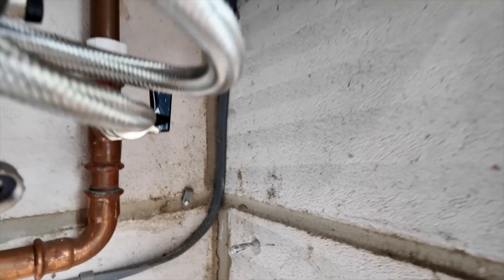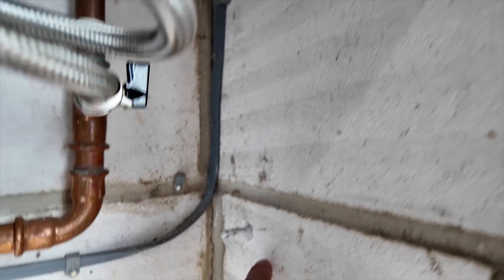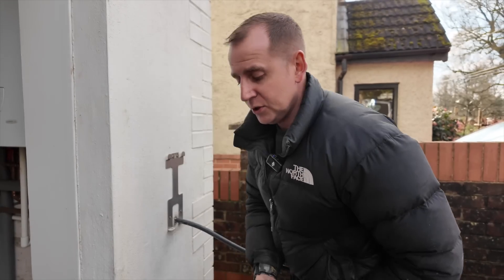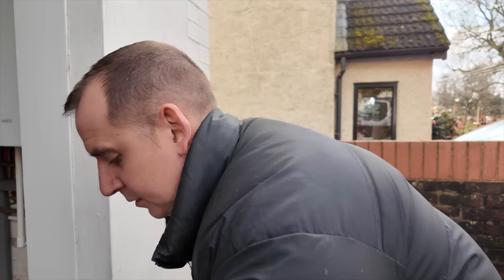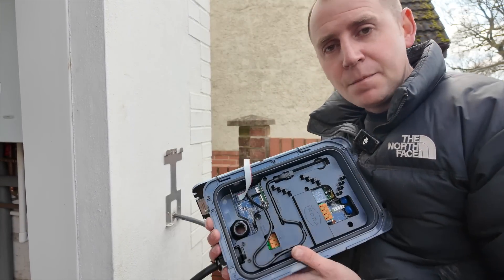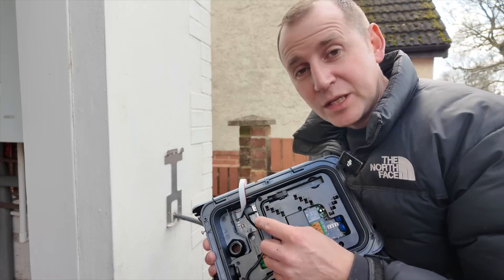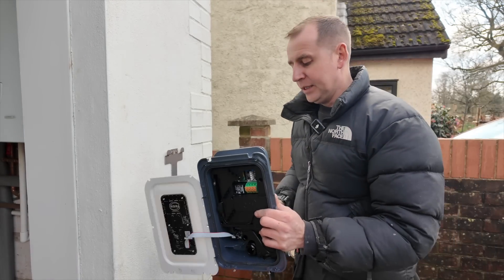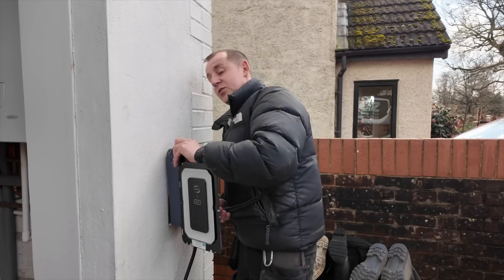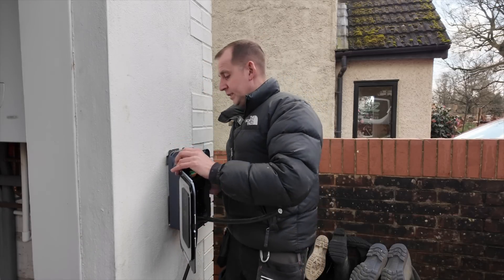That's where we've come out - right there. Once you've got your cable through, slide your charger on. Oh, I've got to put my stuffing gland in first - start again. Once you've got your stuffing gland in - and you can see there's not a million miles of cable route here so we're going to have to get this bang on - slide your cable through the stuffing gland, which is quite difficult actually getting this hooked on and getting this cable through.